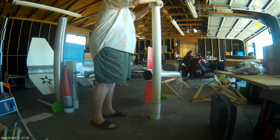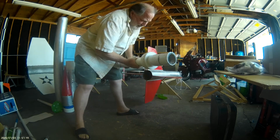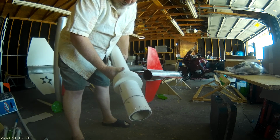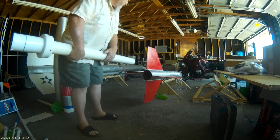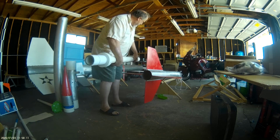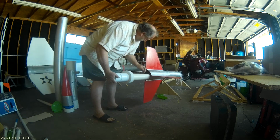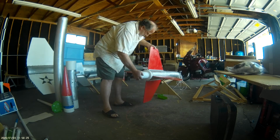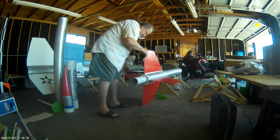I usually install it first, but it will. So that's with the motor mount installed. And after the motor fires, I just cut the tube and remove the motor mount, reuse it. So it fits in the airframe. There's a 3-inch piece of drainage PVC thin wall up in the top that centers the top of the motor with the cap. That's my motor mount, and I put a 1/4-inch screw from each side to hold the motor mount in.